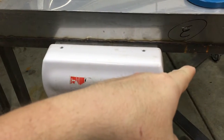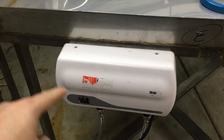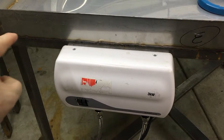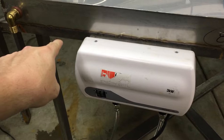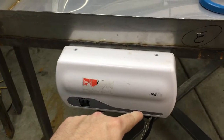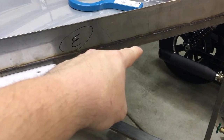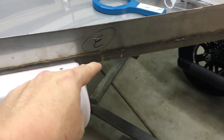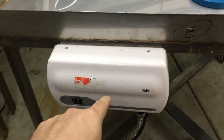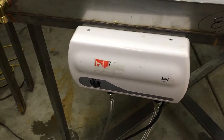I have options on the left and options on the right. This is the intake, and obviously that's where I want to mount the filter before any nasty stuff gets to my sensitive equipment. My problem is if I put it there — I can put the filter in and move it over — but that means my pump is a suction pump. It'll get mounted somewhere over here and it has to pull all the water through the filter and into the tank. I just don't think my little pump has it in it. It's a little 12-volt thing and it doesn't quite put out that much suction.